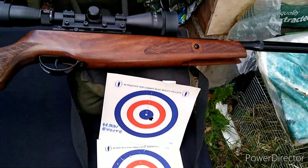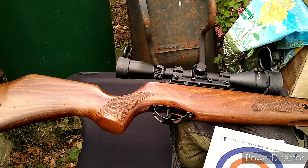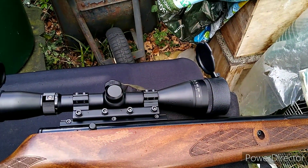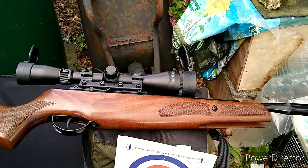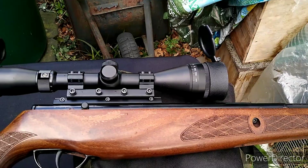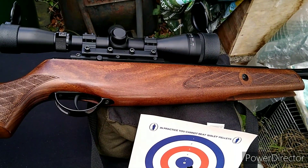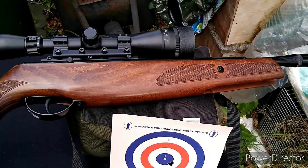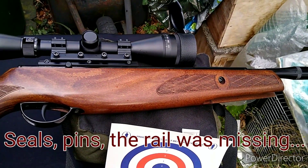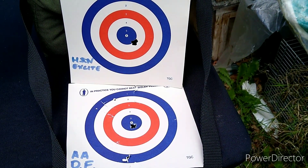Final summing up on the BSA Lightning XLSE project. When I bought it, it was second hand — it was a nail. It had a cheap Chinese scope and cheap Chinese mount. I should have taken that as a warning sign. I've stuck at it, rebuilt it. It's got a brand new OE spring, full trigger rebuild, longer trigger screw, and I've replaced the cocking linkage because it was broken. I've done a lot to this gun — more, really, than I should have. But look what the pellet testing has shown us: some good groups, and I'm pleased with it.